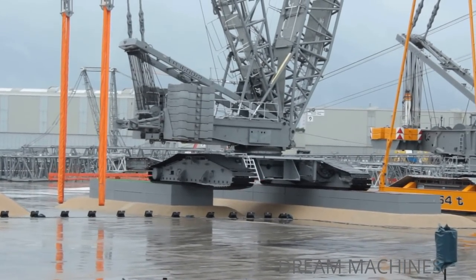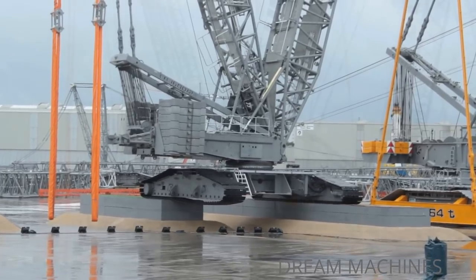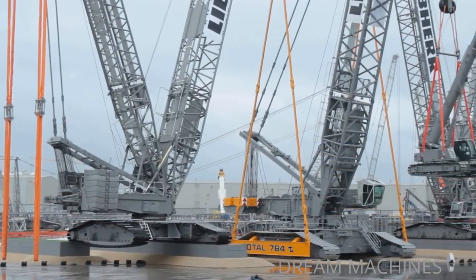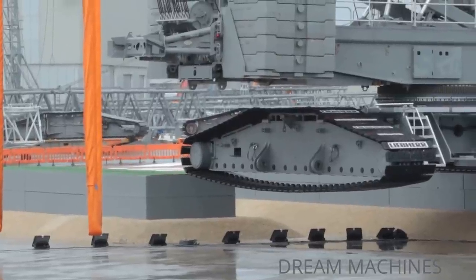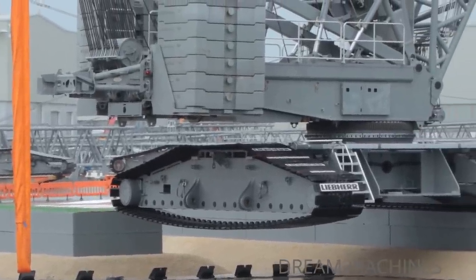Now, to release the rear crawlers, both cranes have to lift the load up. We have a 65% load resting on both of the inner crawlers. All three cranes are running in so-called parallel mode, which means they are electronically coupled in order to move forward.